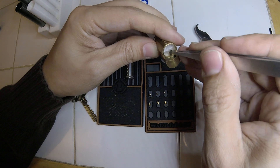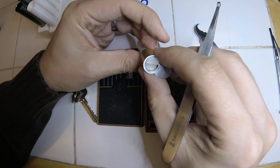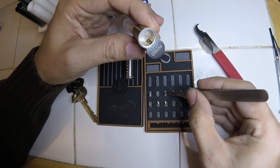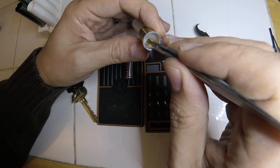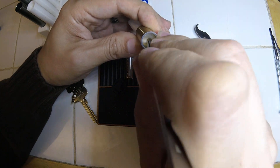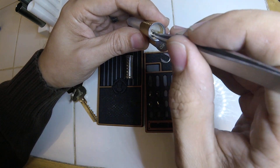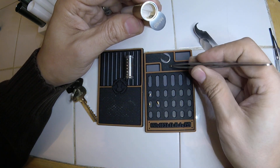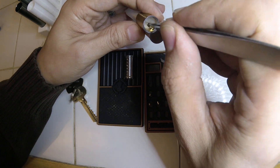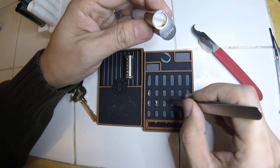There's pin five. I'm actually showing you a couple of different ways to do this, and hopefully it'll help people find their own method. Then pin six. This is going to take a little while because I have to go through all these, but this is just to show you that it can be done quite easily as long as you have some patience. Make sure I take the one that's near the spring. I don't like these short pins because they can be a little bit of a pain to grip with the tweezers and get in.